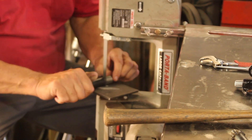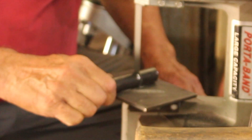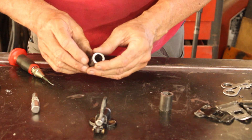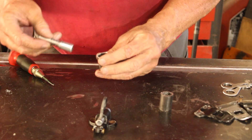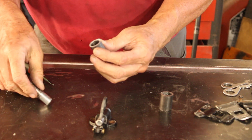So I've repaired the husk of the one I had. Moving right along, I have to fabricate this body and make two more of these. This one's cast iron — I'm not going to make it out of cast iron. I've got some black pipe here that just happens to fit, so we'll make the new body out of this black iron pipe. I have my tube here and the bolt is a little bit loose inside it, so I think what I'm going to do is split this and weld it back together — that ought to tighten it up.